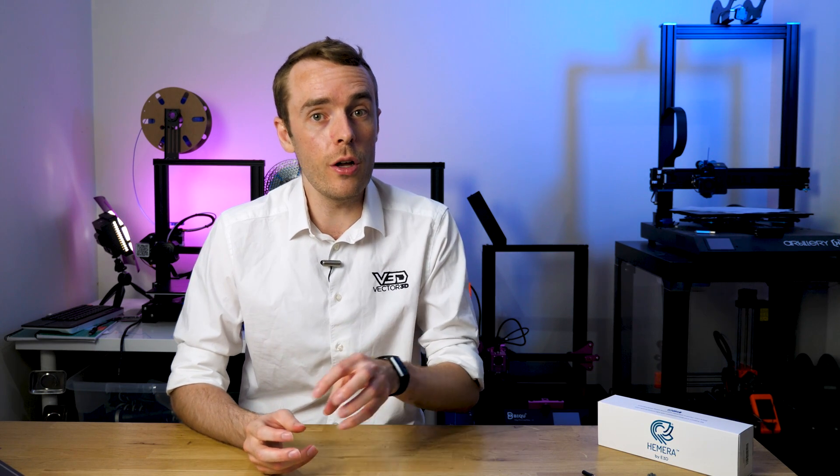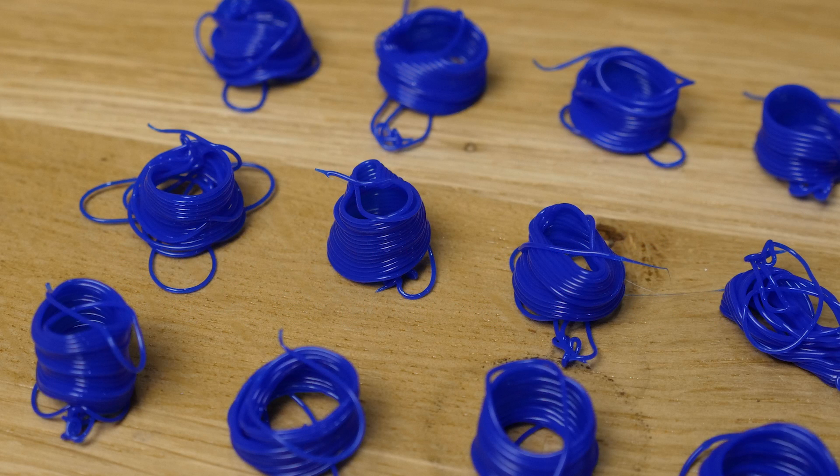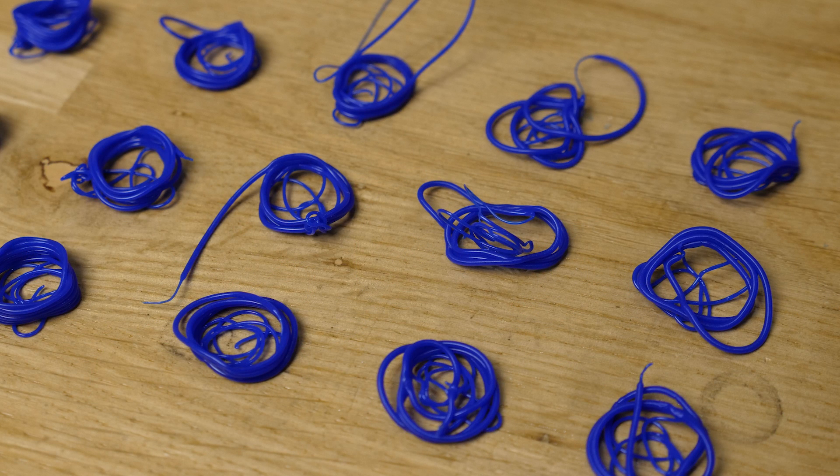Very interesting were the swirls of filament — the test samples that came out of the hotend. On the left side of the collection we can see mostly tidy, even swirls with uniform extrusion diameter very close to the nozzle diameter and a glossy appearance. In the centre, the diameter stays near the nozzle diameter but the appearance becomes more satin and matte, and the overall swirl diameter increases. At the right end — where there were performance issues — the mass is reduced, they didn't form much of a swirl, the extrusion diameter was much larger than the nozzle diameter suggesting spring-back after extrusion, and they were completely matte except for the very first section.